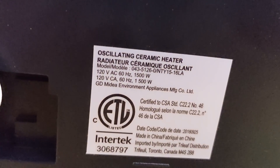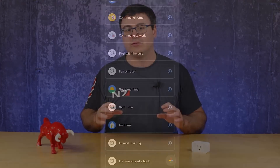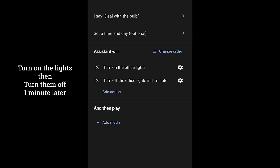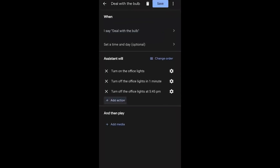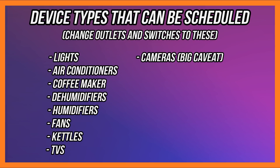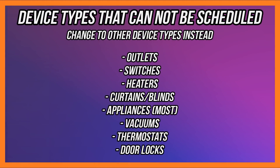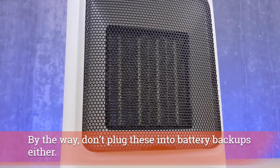This is impacting how companies are treating smart plugs and devices that you've named as a heater or another high-amperage device. Think about Google's new feature where you can schedule their voice assistant to turn something on or off later in the day — you can say turn this on in 15 minutes. But if you tell Google that it's a heater, they won't do it; if you tell them it's a light bulb, they will. They understand from a purely engineering standpoint that they don't really know whether this is correctly protected for your space heater, especially over an extended period of time.